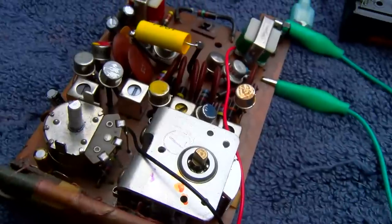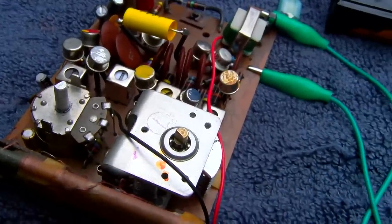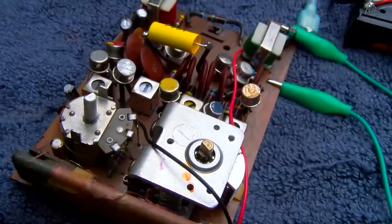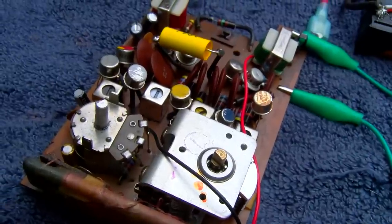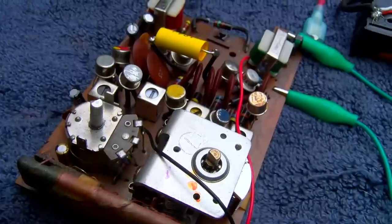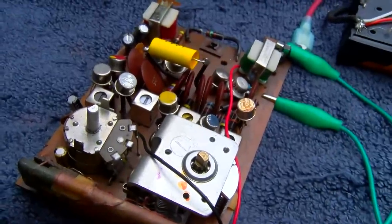Yeah, I got just the absolute faintest whisper of KNX. So let me take it and put it on the signal generator. What I don't want to do is start layering problems. I don't want to introduce problems without correcting the main issue, because then it might get to a point where it'll be almost impossible to get it back to working order.